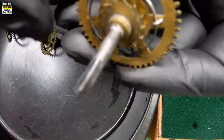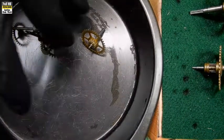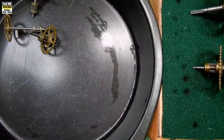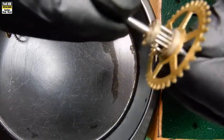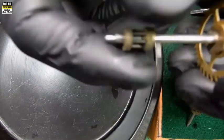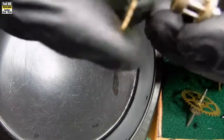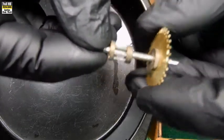All the parts look nice and clean. That's the great wheel and the key winding arbor - that's the end that the spring goes on and catches into. We'll take the rest of the wheels out of the dish and have a quick look at them one at a time; they all seem to have come up pretty well. We'll check the lantern pinions to make sure they haven't got any gunk left in them - if they have, we'll peg them out with some pegwood. That's the escape wheel. There looks like a little bit of a rust mark on the lantern pinion, so we'll check that before we put it back together.